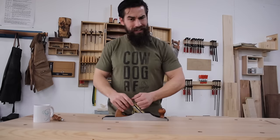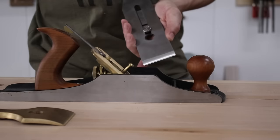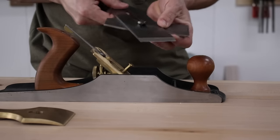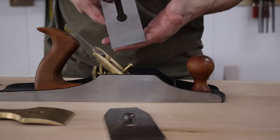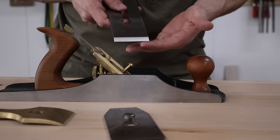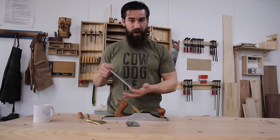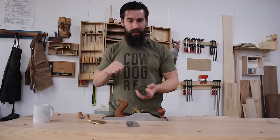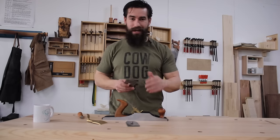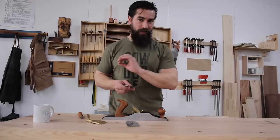The first thing I'm going to do when I need to sharpen up is disassemble my tool. I'm going to carefully remove the blade from the body of the plane, remove the chip breaker, and check for any defects in the plane blade. I'm feeling the edge to see if there are any major dents or dings. I should also have been able to tell from surface quality during cutting if there's damage to the edge. Right now it feels fine, so I just need to give it a little lick and clean up that edge.